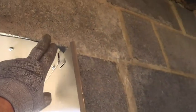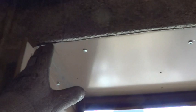So I have the frame strengthened. I added masonry bolts on the top. I cut it flush, cut off the edge, that way the unit can go 4 inches up. There was a conduit strap there, took that off. Now I'm going to mount the grill to the outside.